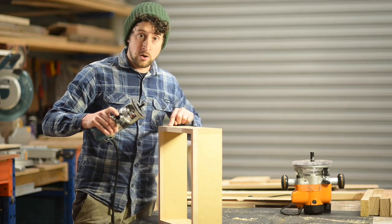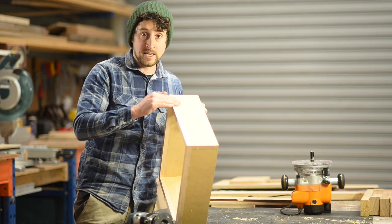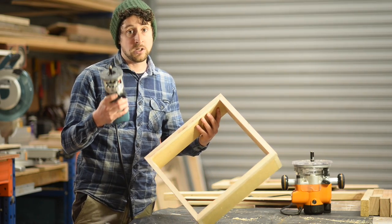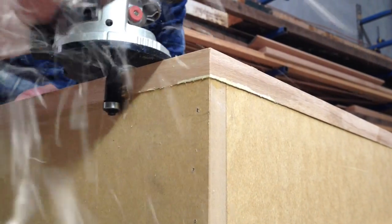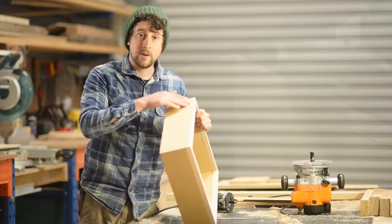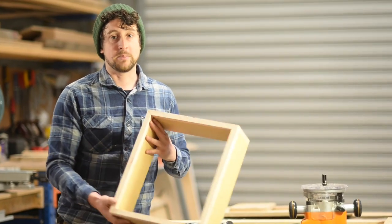The bearing itself will run along the MDF, and the blade will bring the level of this hardwood face back to exactly the same level as the MDF. Dead simple to use, really common application. This can be applied to lots of other projects as well. After running the router around the outside and inside, they're both perfectly smooth - giving you the kind of result you need if you want to put a nice timber face on your cabinet work, drawers, shelves, or whatever the application might be.